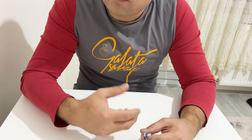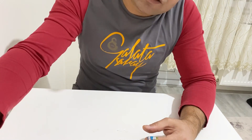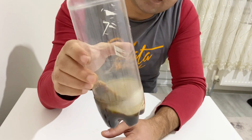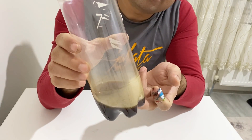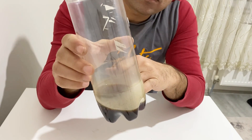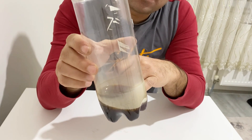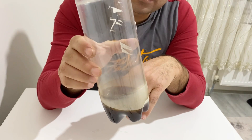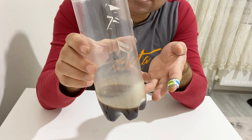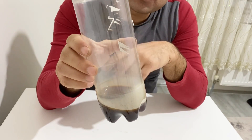If you want to learn how to make a supercapacitor you can visit my channel and learn everything about supercapacitors. Now let me show you the electrolyte I will introduce in this video. This is one of the best and cheapest electrolytes for a supercapacitor. As you can see it is a brown color electrolyte. Inside it I have deionized or distilled water, some acetone, and also sodium hydroxide or potassium hydroxide.